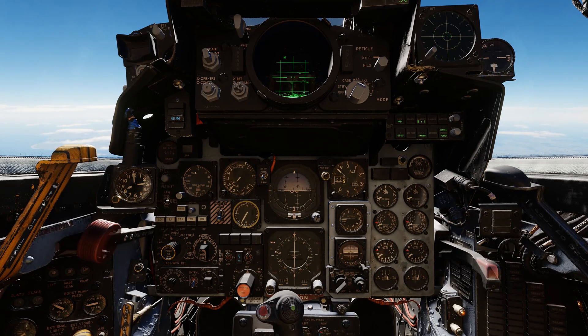The fuel gauge is located on the upper part of the right main console and has two parts. Total internal fuel is reflected on the gauge times ten — right now we have about 12,000 pounds of internal fuel. There are no gauges for the external tanks. The top tape shows fuel in cells one through six. To check cell seven, actuate the check engine feed tank switch, which will show approximately 1,400 pounds there, staying until cells one and two are depleted.